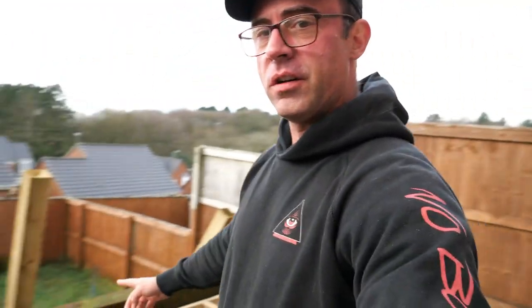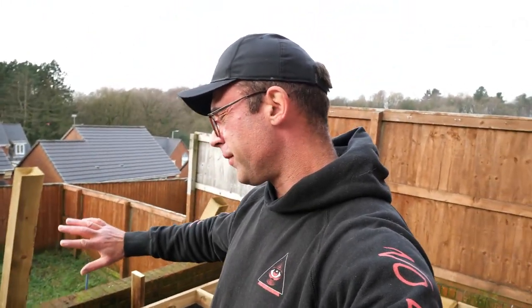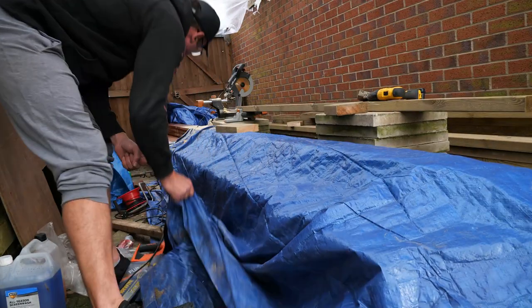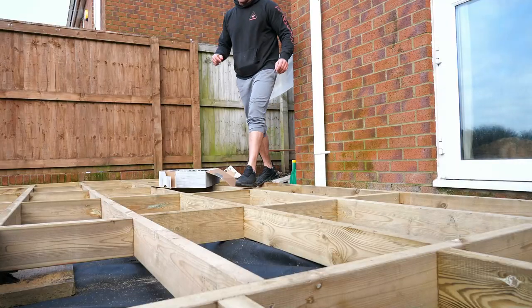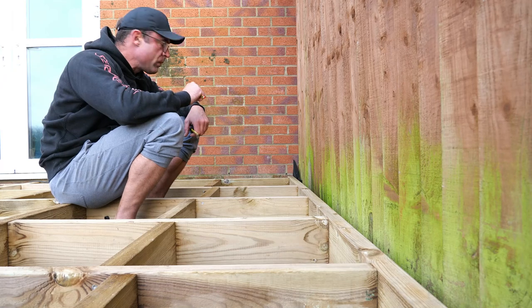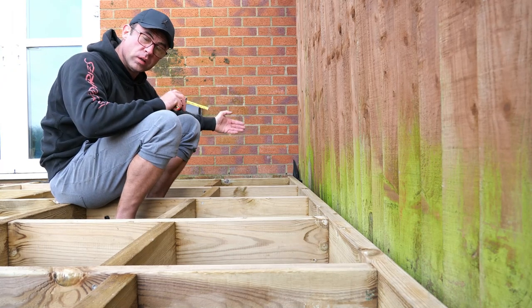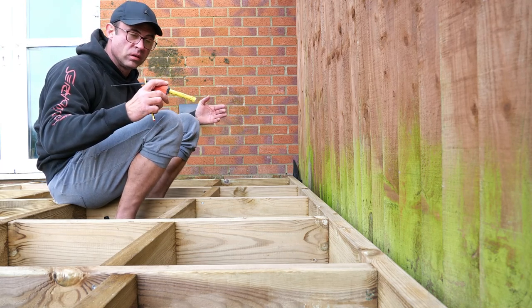Little lady's been dropped off. The posts are in place. I'm not sure whether to put the fascia board on first, but actually I think I'm going to start laying the decking boards - let's just do this, wish me luck. I'm going to start on this side first and work my way back, leaving about 25mm gap between the wall and the first board so that when it rains and the wood expands it's got room and won't buckle away from the base.